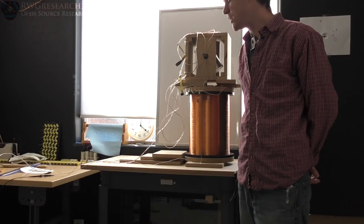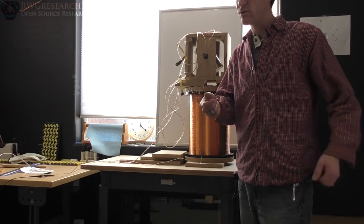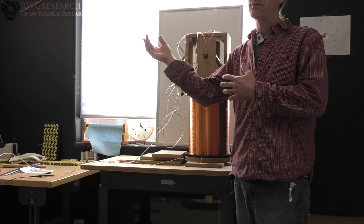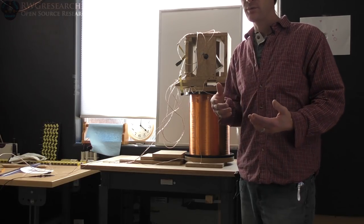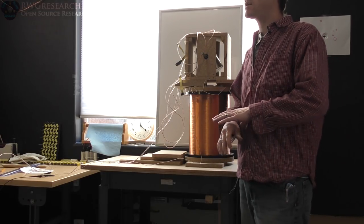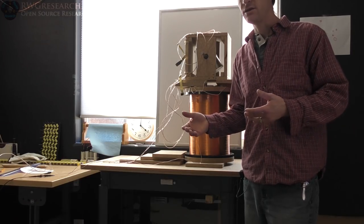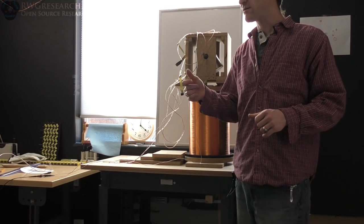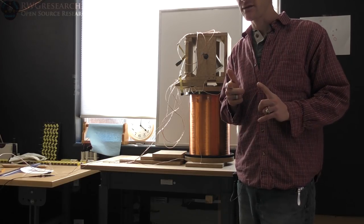It's very critical. In the past experiments, we played with capacitors. Okay, we made our own. That was awesome. We got to see how they react when you take them apart and put them together. We made a couple of coils and capacitor circuits and played with how those react and how to dump energy from a cap to another cap through an inductor and save almost all the energy by also creating a magnetic field. We did all these simple tests. We used a switch, a relay, and just tapped it. And all these little things are crucial to understanding the global scheme of what you're trying to do. If you don't understand all the aspects of your system and you don't take the time to go through that, then you're not going to get to where you want to go. I'm pretty convinced of that through my own experience. So, let me go to the next test. That's the end. Let me jump over to the last few bits of what I want to tell you, and then we'll let you go.